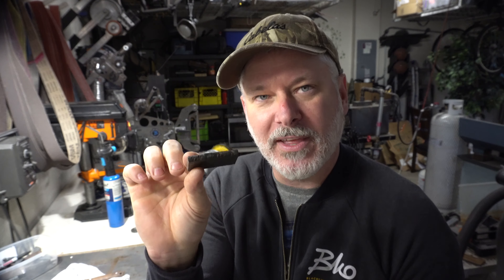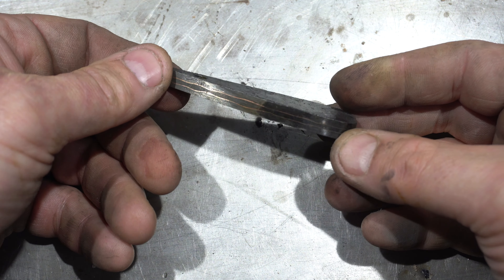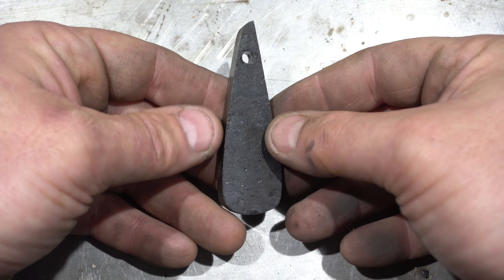I had this little piece — I think it's from one of the K-bar builds, though I don't quite remember. After etching, I realized this one is actually Damascus and the other is not, so this is the one we're going to use. We'll clean it up on the grinder, put some nice bevels in it, and it should show off really nicely.